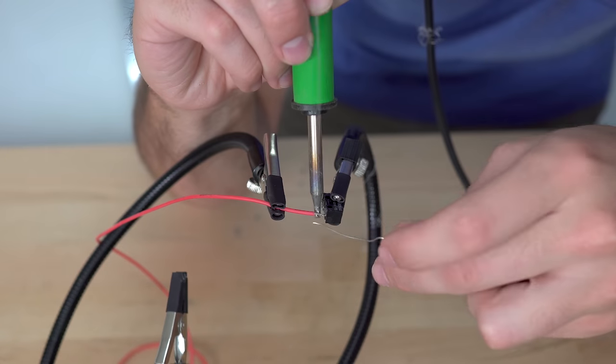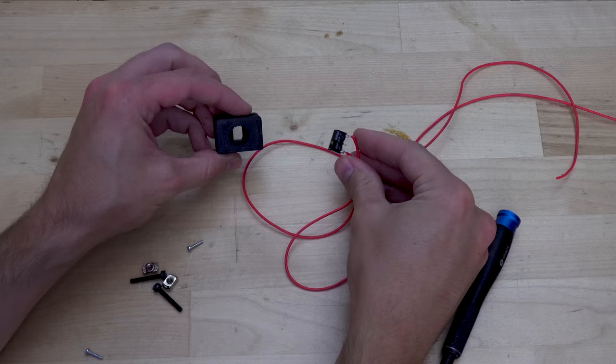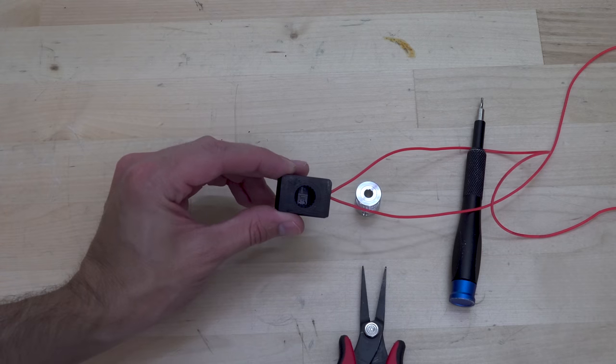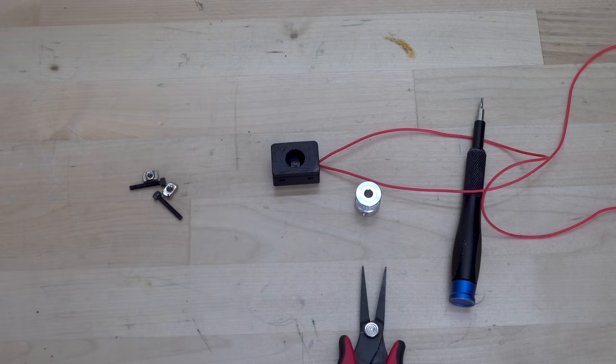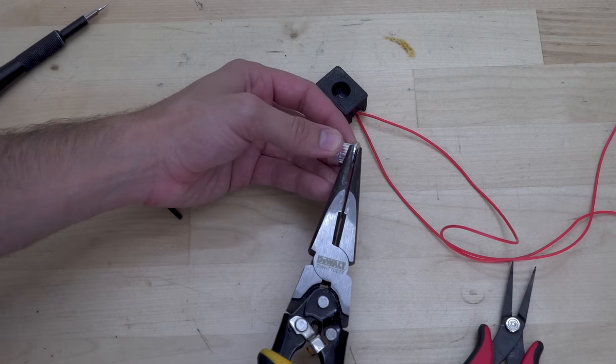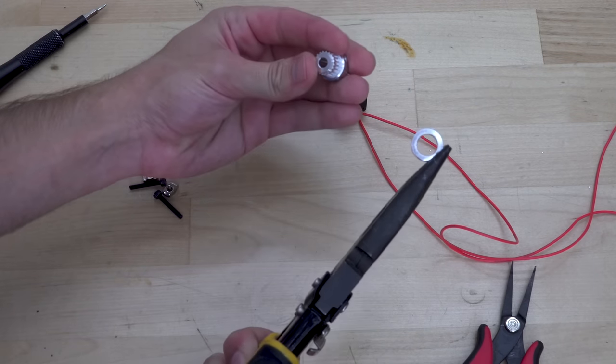The design for Voron's endstop is actually really cool. You have a mechanical switch that sits inside of this plastic housing. If you look down its barrel, you can see the little button for the endstop. But around the perimeter are these ridges that accept a deflanged pulley. It's actually remarkably easy to deflange a pulley. You just pull on the end of it with some pliers.